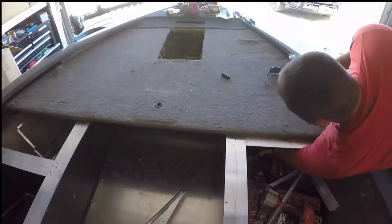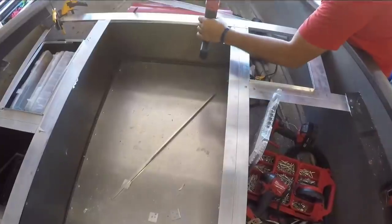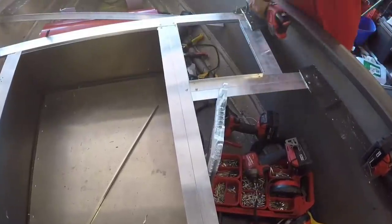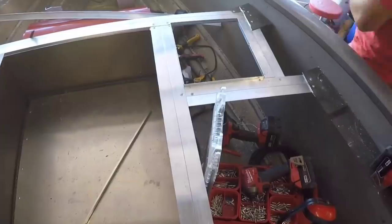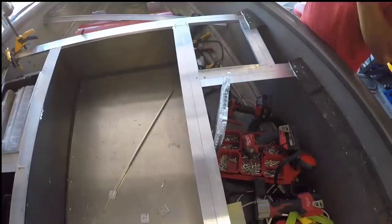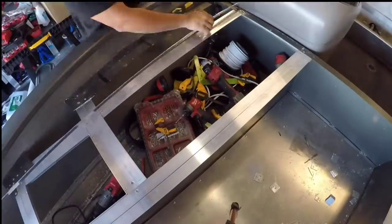We're putting the old deck where it used to be and tracing out where the new compartments are going to be, so when we go to cut them they'll all come straight. We had some inside info from a Tracker tech who actually worked on this boat back in the day — to make sure you have as many sections attached to the side rails to keep the frame stiff so it doesn't try to buckle in when it hits a plane.